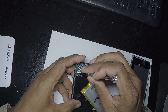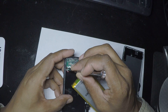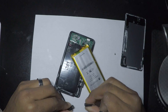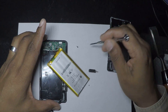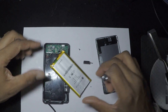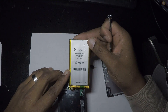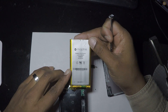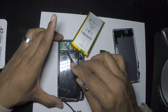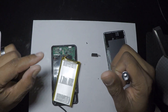I do want to see what I've got for voltage readings here. There goes the screw — it must have come out from somewhere in here. And there you have it: a Mophie lithium ion polymer, 3.8 volt, 4060 milliamp hour battery. For some reason I'm not getting voltage here, so I'm going to look into that and see if I can find out anything.